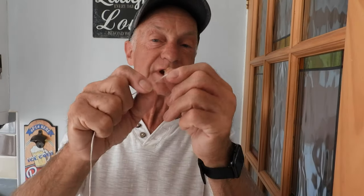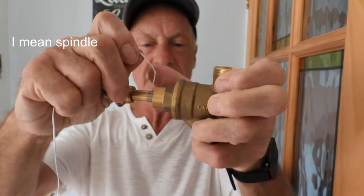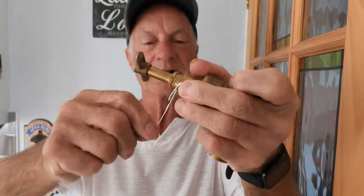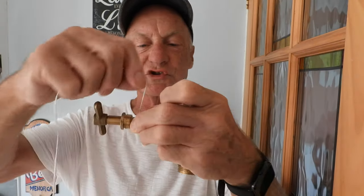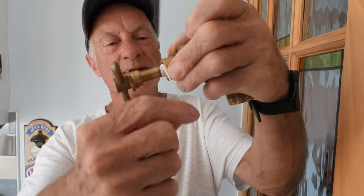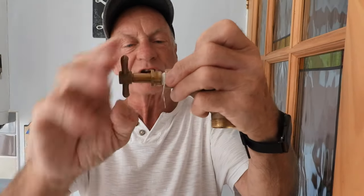If you've got some old wax string, that's even better. And if you've got hemp with a bit of boss white along it, that works even better than PTFE tape. But most people have PTFE tape and it costs about 20p for a reel, so it's a simple thing to do. Pull your gland nut back up the thread, then wind the PTFE string around the end of the spindle. This is a three-quarter stopcock so you may need a bit more for a half-inch one.